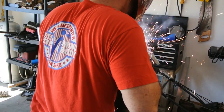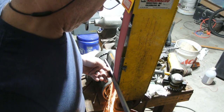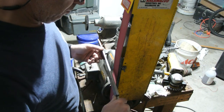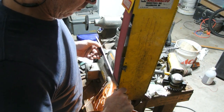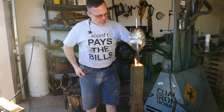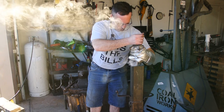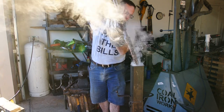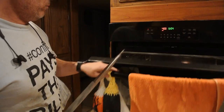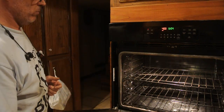We're going to go ahead and weld this thing up — a little bit different though, we have to go all the way around the outside. I didn't get the entire process of drawing it out, but you get the idea — it's the same kind of thing. Here you kind of get an idea of what the blade's going to look like in shape. I got a little ahead of the game, forgot to do the beveling, but here's the quench! Right as this comes out, you can see that copper kind of stand out against everything else. Now that it's all heat treated, I cleaned off some of the excess scale from the outside and I brought the knife inside and set it to 400 degrees on the inside oven — and don't tell my wife I used the inside oven.